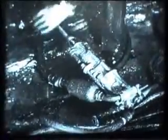From 10 to 12 machines are coupled to the hoses and fitted with 6-foot rods. We use only one rod length to each shot hole, that is the depth of the pull. Drilling is done to a set pattern of 7 rings. Directed by the foreman, the number 1 driller starts on the first of the 4 shot holes which make up the center core. These are drilled at an inclined angle to give a maximum center lift.